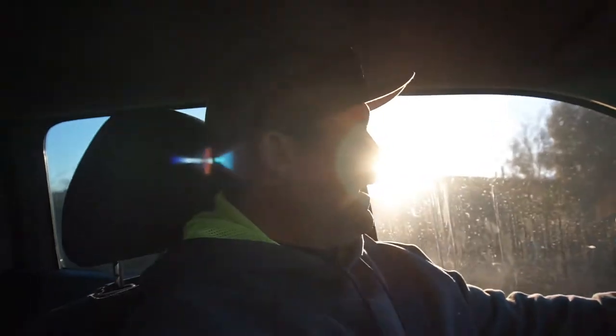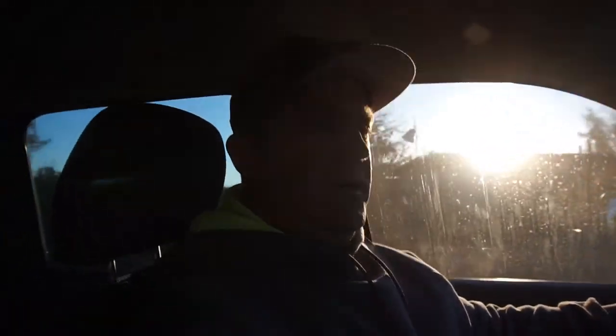But basically, I didn't really use much filler rod. I had everything butted up really tight. I had everything straight, exactly where it needed to go. I had my little angle magnets and everything holding it all up. So anyway, it came out pretty good. I think it came out pretty good.